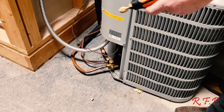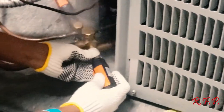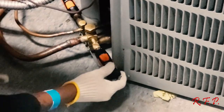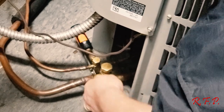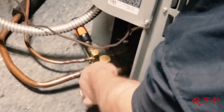Are they all like that, or does it depend how you hook them up? No, if you've got the loose fitting ones, when there's liquid in the line, it makes it worse. Start your fitting screwing on there before you let it go. Yeah, it's okay, the light doesn't matter. Keep going, keep going. What you want to do is hold that nut back and get it started. Get your nut started on there, and then when you get there, you just do it quick. When it starts squirting a little bit, just do it quickly.